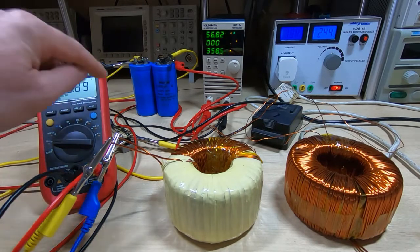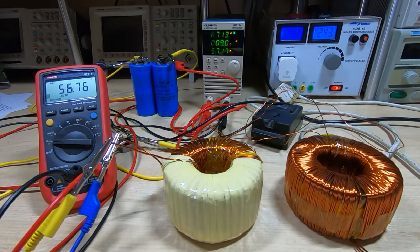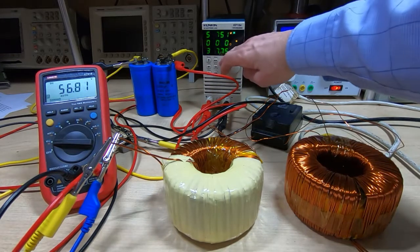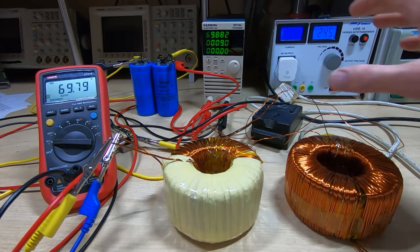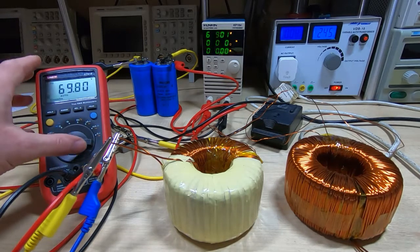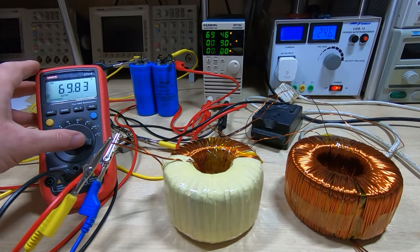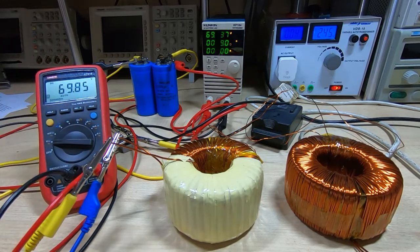We can see we're down at about 57 volts, which is showing a volt lower than I actually want. However, once we get the proper rectifier in — which I designed it for — that will be about one and a half volts higher. And of course when running directly from the mains it will be a bit higher again, so as a rough estimate I would guess we'll be looking at slightly over 60 volts DC once we've got the proper rectifier and we're running directly on the mains.